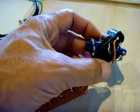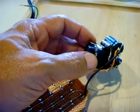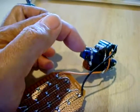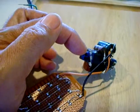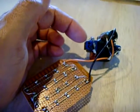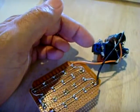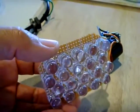Now if you're working on 250 volts instead of 125, you're basically going to cut the capacitors in half. So if I'm using four UF in total, you want to use two UF. And make sure you use a 400 volt capacitor or higher. You can leave everything else the same.